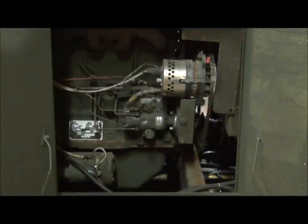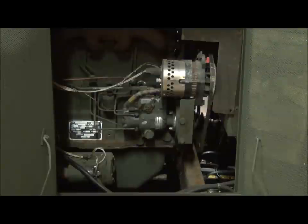This is the last panel we'll be doing any work in. All I'm going to do is tighten up that fan shroud to make sure it doesn't hit the pulley on the alternator and double-check all the fuel line connections. Then we're going to loosen up the main fuel inlet to the injection pump, turn on the fuel pumps, and wait for clear fuel to flow out. This flushes any old fuel from the lines and lets me see if there's any sediment, particulate, or water before it reaches the injection pump.